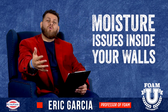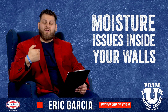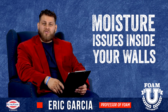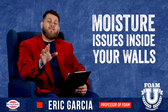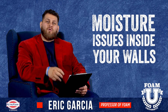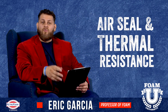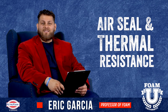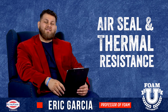What can happen at that point is moisture can come through the foam, and now you're trapping moisture between the foam and the fiberglass. Over time, that fiberglass can become saturated and cause all kinds of moisture issues inside your walls. That kind of goes right into the cost effectiveness, because you will have to bring that spray foam out thick enough to achieve an air seal. Once that spray foam is to the point of achieving an air seal, that's probably enough insulation to give you a thermal resistance also. So again, it's probably not actually cost effective to add fiberglass on top of that.